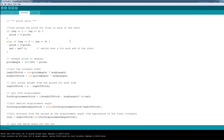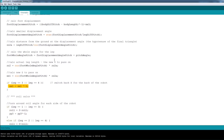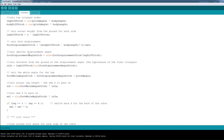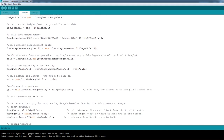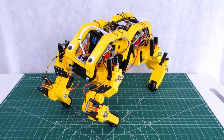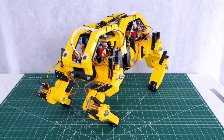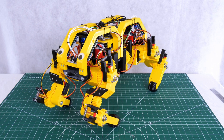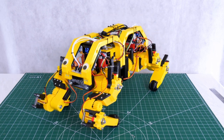I'm not going to go through every line of the code — it will be published, and I've written it out in clear stages with good variable names. There are several places where things get switched over and back again, basically so the triangles work the correct way for each side or end of the robot, with offsets removed to center things around zero and hand values correctly to the next stage. The variables from pitch get handed to roll, and then roll gets handed off to the translation axis. We've got our pitch axis working quite well, and our roll axis too — it should be pivoting the robot perfectly in the middle. Those axes also mix with everything else: I can go forward and roll, or pitch, or move sideways, or make it shorter or taller, and all the axes still work.